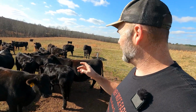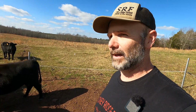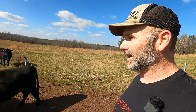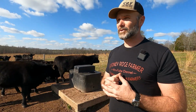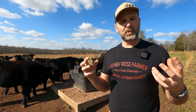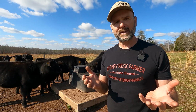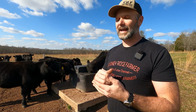The problem we had was this tank down here ran out of water, then this tank down here ran out of water, okay? What I saw was these two blue balls were not floating. So first thing I did was go up and I turned my big water tank up on, and that filled everything up. I failed to turn it off once it filled everything up, and that's why it all leaked out. We can pump up to, I believe, 25 gallons per minute, but don't quote me on that. My well provides 20 gallons per minute, and again, we have the flow rate set at 4.5 gallons per minute so that we'll never ever really drop the level of the well. And I set that up in that app by myself.